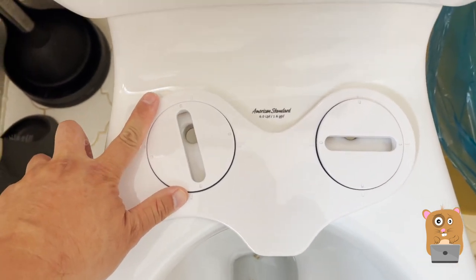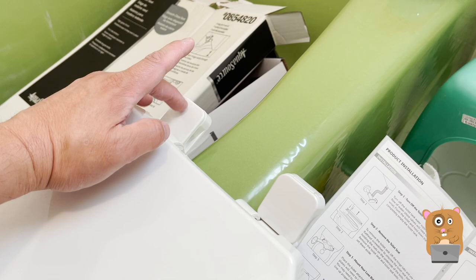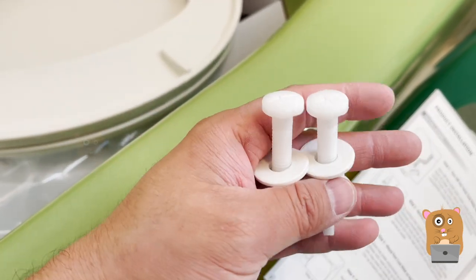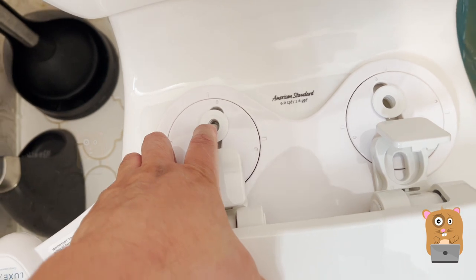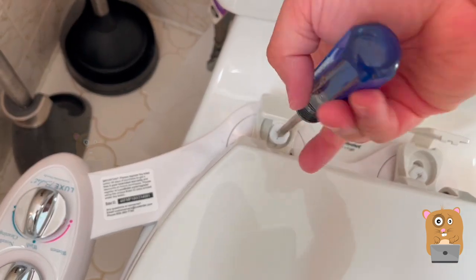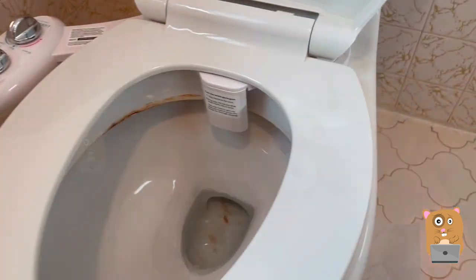Place this on here — I'll need two hands for this. When toilet seats are slow-close, the hinge on the right-hand side controls the slow-close for the lid, and the left one controls the slow-close for the seat itself. As for the mounting hardware, it's mostly plastic. The opening here is pretty narrow — when I place that rubber silicone washer in here, you can see that it becomes elongated, so it's going to be a tight fit. I'll take a screwdriver and push it in or screw it in. Put this piece up, place this on the bottom, and on top start threading it in. Toilet seat is installed.